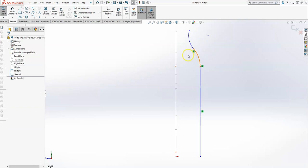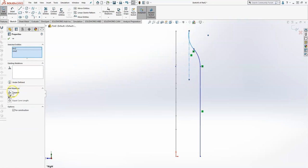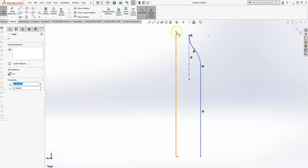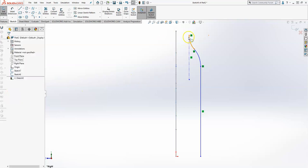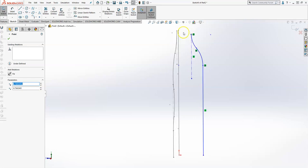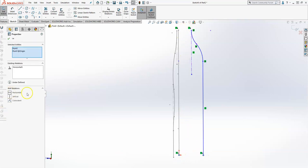Now the points of interest are: I'll need a centerline — I'll just go ahead and attach it here — and that's so I can take this line and this arc and go ahead and make them tangent. Then grab the top points and make those horizontal, so all my sketches will line up horizontally constrained. I might have to shift it around a little bit, and now that's horizontal.